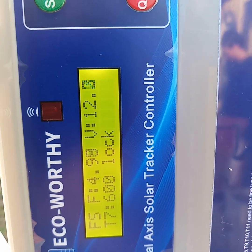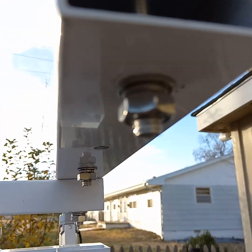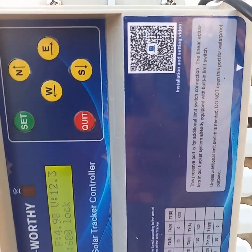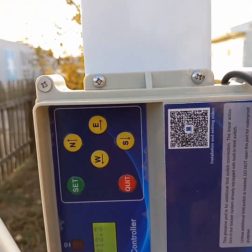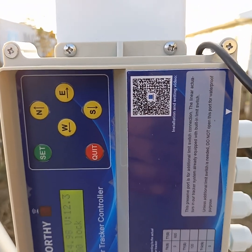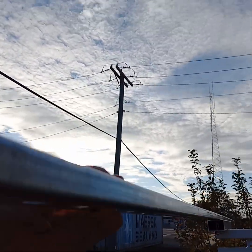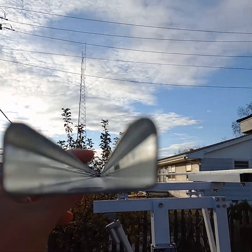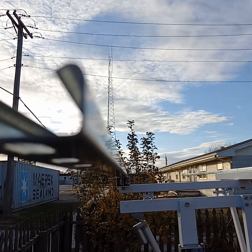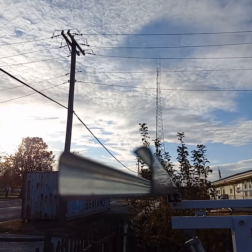It's going to be a real pain to take it all down and pack it back up. By the way, I'm missing some bolts. Something I couldn't figure out — everybody kept saying these things had horrible bolts; I thought they looked okay. But since I've changed the angle of a few things on this unistrut — and I see a lot of people asking what this is — this is unistrut. It's a one-and-five-eighths inch by thirteen-sixteenths galvanized unistrut. Menards is where I found it cheapest, at about thirty dollars for a ten-foot piece.